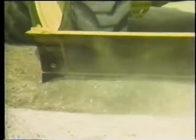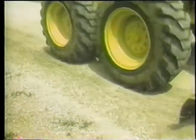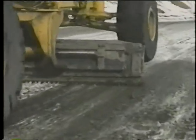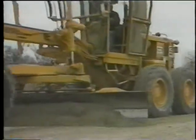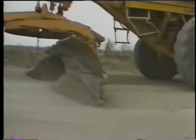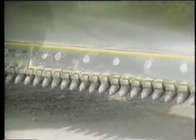Also, the spaces between bits leave the fines with the gravel instead of separating them. In addition, less expensive pit-run material available in some areas can be used instead of more costly processed gravel, because the bits screen out the oversized rock and waste it on the shoulder — in effect, the scarifying blades process the pit-run material in place. Altogether, scarifying blades may lower maintenance costs by maintaining more road with the same time and effort, reducing machine time and labor costs, reducing new gravel costs, and producing better-maintained gravel surfaces. Local agencies should investigate and decide for themselves.